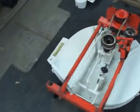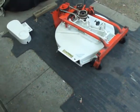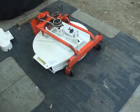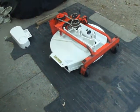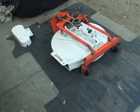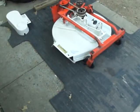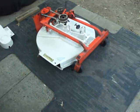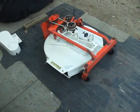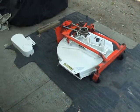So yeah, that's the story on that. A 1967 Ariens rotary attachment, model 35-10M, for the Ariens 10,000 series Sno-Thro line. The Sno-Thro bucket comes off and this goes on. 26-inch cut, 7 horsepower engine. I had to put the air filter on and take the heater cover off. My 32 wide is powered by a Predator, but that one has much thicker chains. So there'll be a part 2 because it's kind of hard to attach.